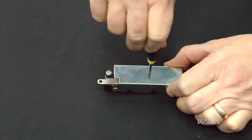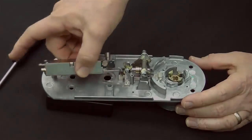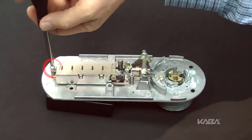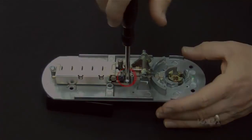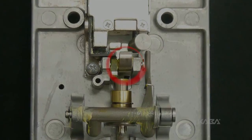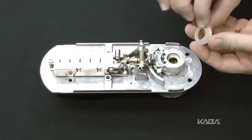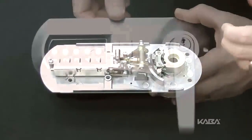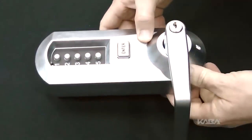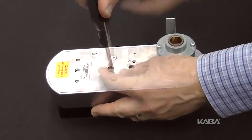Reinstall the three-sided dust cover. Lay the base plate flat on your work surface. Reinstall the combination chamber assembly to the base plate with the two Phillips screws previously removed. Ensure the cams are in the orientation shown. The thin cam should rest against the black unlocking slide, while the thicker one rests against the piston. Place the outside lock assembly on the base plate. While holding the assembly together, turn the assembly over and reinstall the two Phillips screws removed earlier.